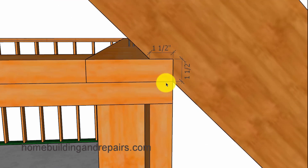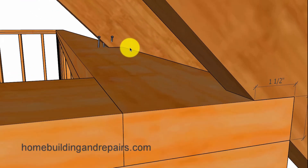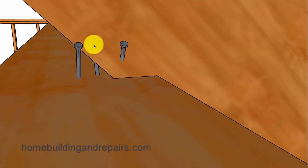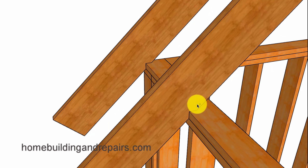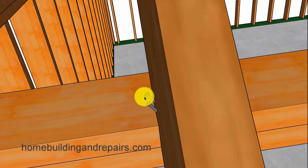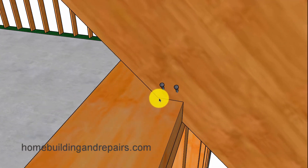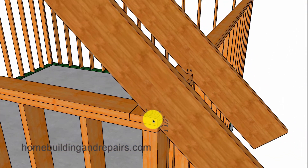And this video wouldn't be complete if I didn't provide you with a smaller seat cut — something that you're going to have a difficult time installing the nails in. I left the nails at the previous position for the other rafter. However, I'm not about to suggest that you can't get the nailing you need with a one and a half inch wide seat cut, because I have seen seat cuts that were about an inch long and I'm sure the houses are still standing.